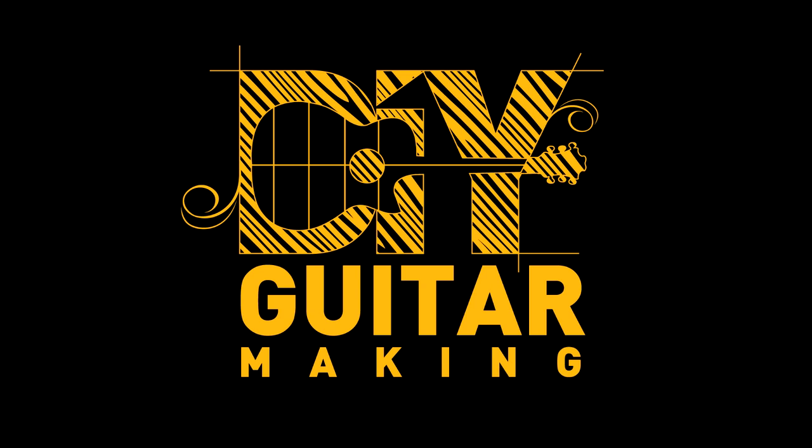The disadvantage of evo gold is that it doesn't bend well — it's too brittle and tends to kink or break. Nickel silver, on the other hand, will bend very easily, so you can put it in a fret bender and curve it to your desired radius. With evo gold, it comes with a pre-radius from the factory, and you have to make that radius work with your fretboard. For a new builder, it might be wise to stick with tried and true nickel silver. But for veteran guitar builders who haven't used evo gold yet, give it a try — it's definitely been an improvement for me.